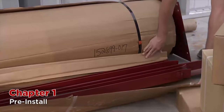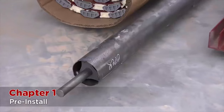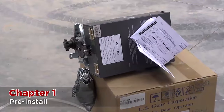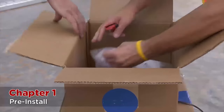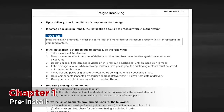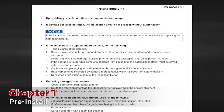Check to make sure that you have all the pieces: guides, bracket plates (sometimes called head plates), barrel (sometimes called shaft), hardware, curtain, motor if required, and the hood. Open the hardware box to expose the hardware, drawings, and installation instructions. If there is any freight damage or the delivery is incomplete, please follow the procedure outlined in the installation and maintenance manual in order to correctly address any issues.